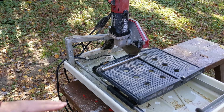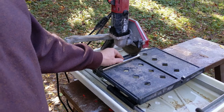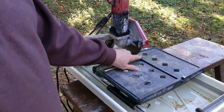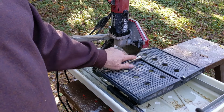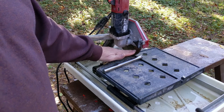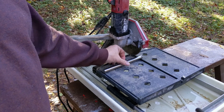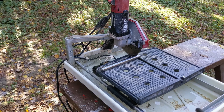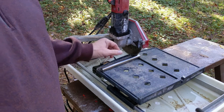I dug up the old wet saw — I've got some water in there. This is the tungsten bar. There's the groove I started after a few minutes with the abrasive wheel chop saw. I've got the diamond cutting blade in there. My friend Don advised me to go slow, so that's what I'm going to do.